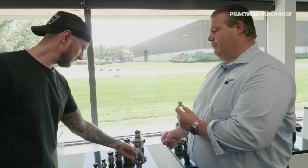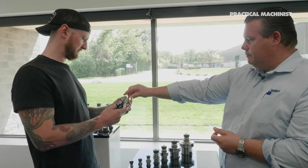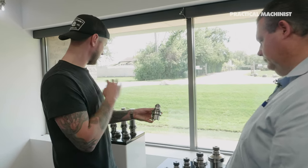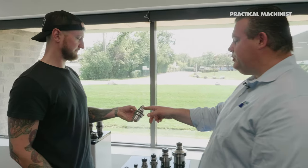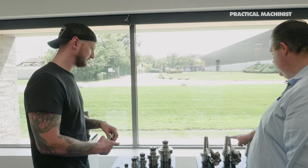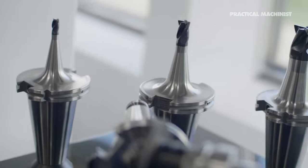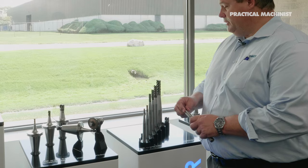And that's with a standard collet wrench — just wrench it on. I didn't realize they could get that precise. I have to ask about this design I see across a lot of Haimer products — is it decor or is it function? Whenever you see the Haimer sine wave on a holder, that means it's a Power series, designed to dampen vibration. You see it on the Power shrink, the heavy duty shrink, and the Power Collet Chuck — but not on the standard series.